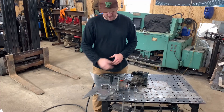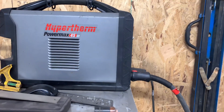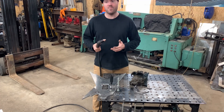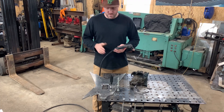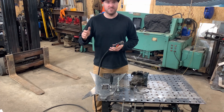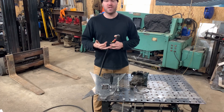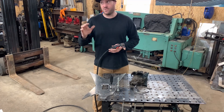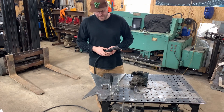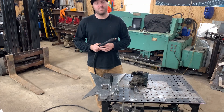I have the relief cut marked out and I'm getting ready to cut it. What I'm going to use is my Hypertherm 45 XP machine — great little machine, very versatile. It has a gouge setting if you're into doing buckets or anything like that. What I will say about these machines is that as excellent as they are — I use this every day — they will burn the hell out of you. They like to throw molten material everywhere. It's plasma arc mixed with compressed air at around 85-90 PSI, so those sparks flicker pretty good.